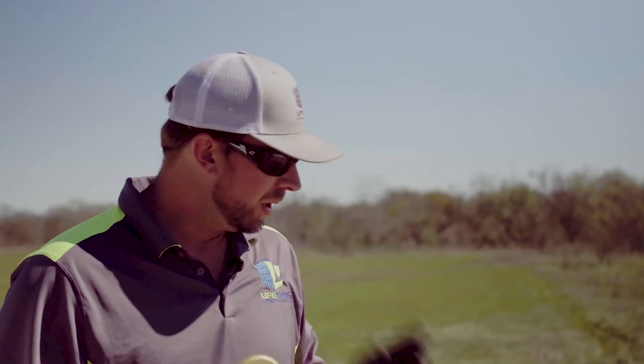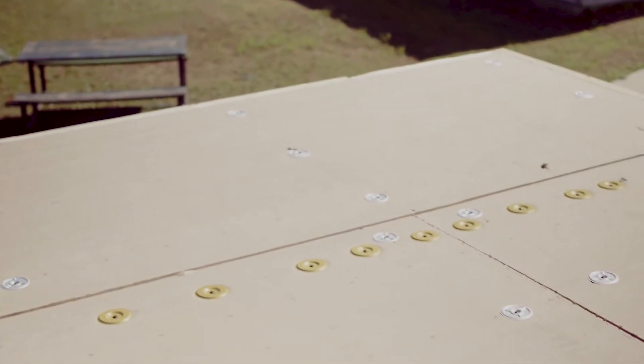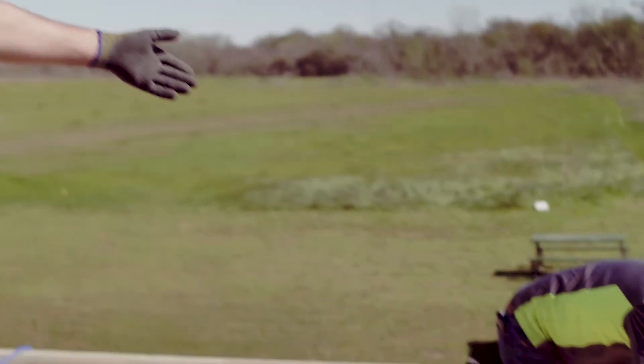We have installed these Rhino Bond plates. We have screwed them in a straight line into the purlins of the roof. Now that we have the Rhino Bond plates installed on the purlin, my assistant Matt is going to roll out the TPO.